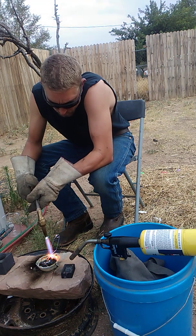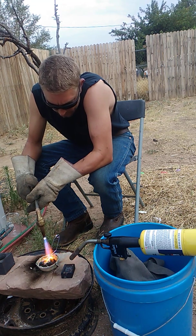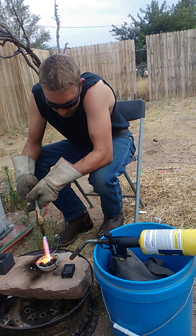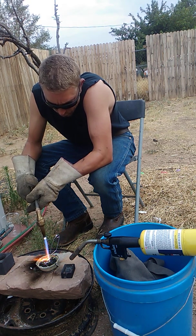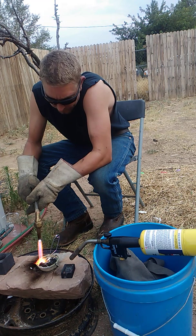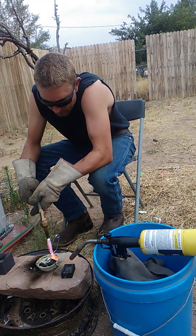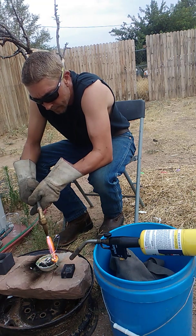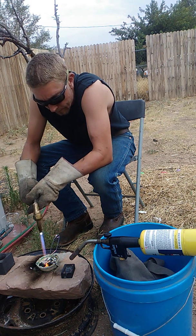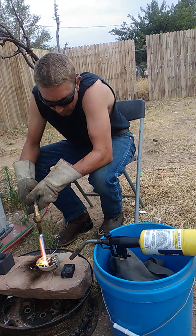Normally I would be moving this torch around a lot, but I'm hitting the metal hard so that it melts faster. I'm also trying to burn off the excess carbon that I just left behind because of the carbonizing flame. I'm actually gonna use cutting power here, but I don't want to blast any of my material out — and I'm already losing a little bit.